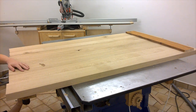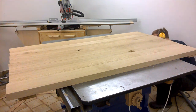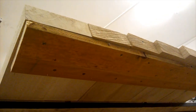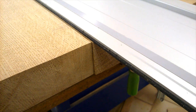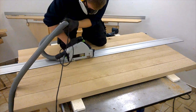To make them match up perfectly I screw a board underneath each of the ends to keep them securely in place. Then I use the circular saw and a straight edge to make a cut right through the joint. Basically the saw cuts both pieces at the same time. This ensures that all the pieces will match up perfectly even if the saw is not set to a perfect 90 degrees or some side wobble is introduced.